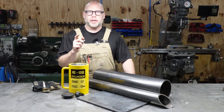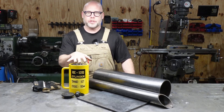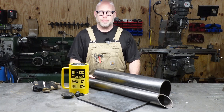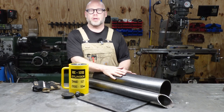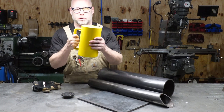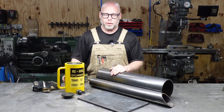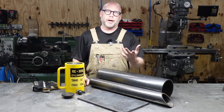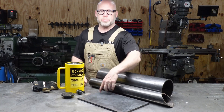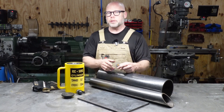We're back with the next phase of the 100-ton press. I've got one of the 50-ton cylinders here just so you can visualize what we've got. We have some three-inch pipe and some five-inch pipe, and the five-inch pipe is going to become the housing that hangs this cylinder upside down from the top of the press. We drew that up in Tinkercad to give you a visualization. We've got a plate to cut some mounting plates from and the pipe that we have to cut in half because we need two of them — we have two cylinders.